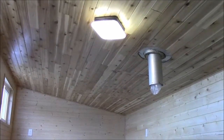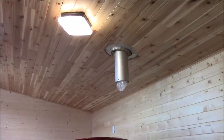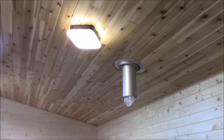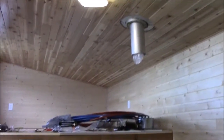To put things into perspective, right now I have two overhead lights here, each with two LED DC bulbs. Basically all four of those bulbs together are just under one amp. So theoretically, off this 100 amp hour battery, if I went from fully charged to completely dead — which obviously you don't want to do — I could run these overhead lights for 100 hours off of this battery.